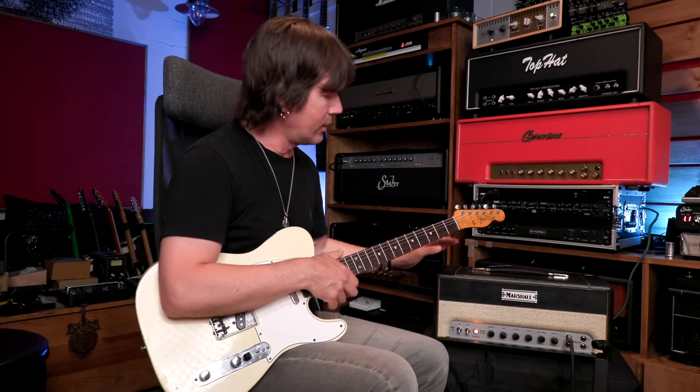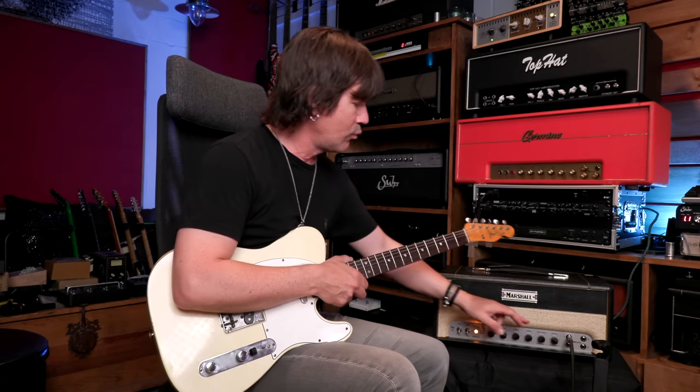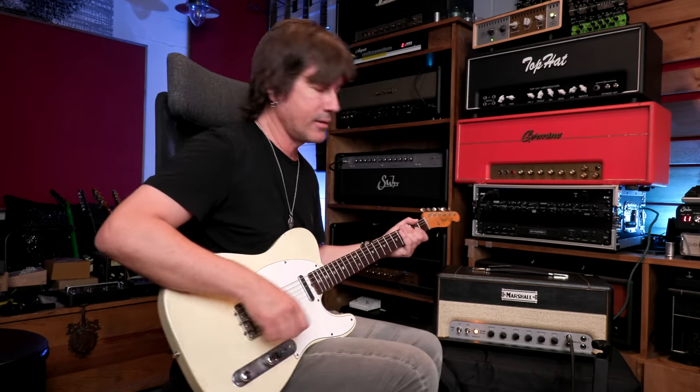The cool thing about a JTM 45, and this isn't to say that 1987s or 1959s, the later Super Leads, aren't awesome, because they're actually some of my favorite amplifiers of all time, but they are sort of more one-trick ponies, and that's because of the bright cap. I've talked about this extensively on my channel, but on a JTM 45 they've got a totally different bright cap, and it makes the range of usable volume across treble channel volume one really usable all the way across. So I'll show you what I mean.